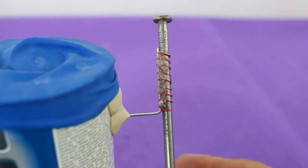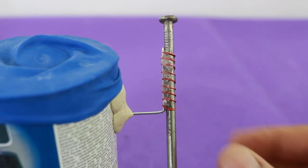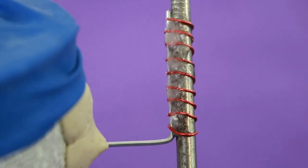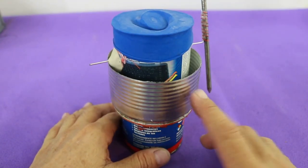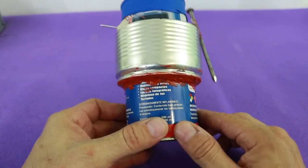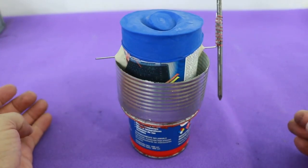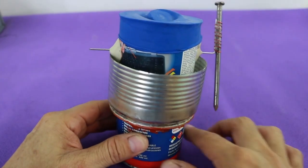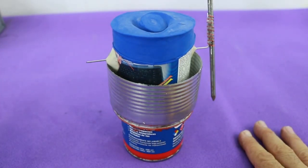The flywheel is a large nail - a 4-inch nail. The axis was bent at 90 degrees and I fixed the nail with some wire and a mix of cyanoacrylate and baking powder. The last step is to cut a can of a larger diameter and put it in this way using high-temperature silicone. We will put water here to refrigerate the engine. Remember that Stirling engines have two sides: a high temperature side and a low temperature side. The larger the temperature difference, the more efficient our engine will be.